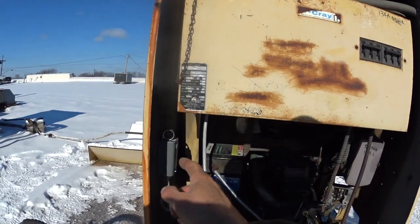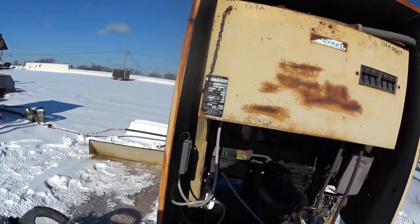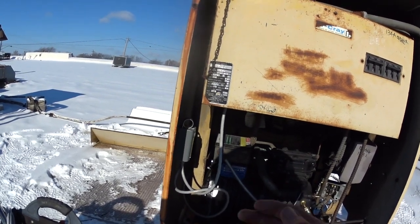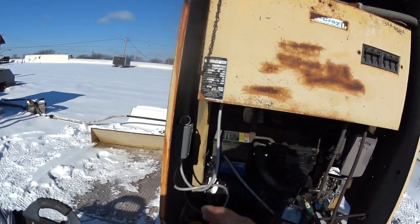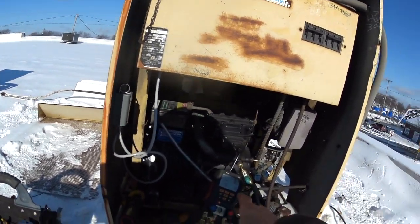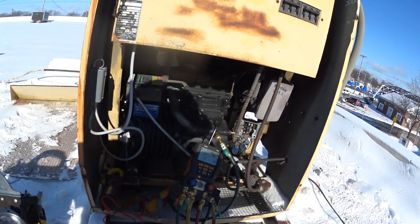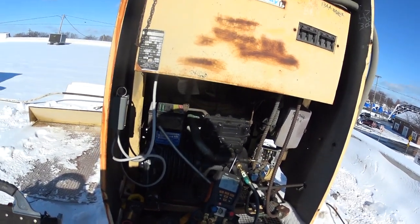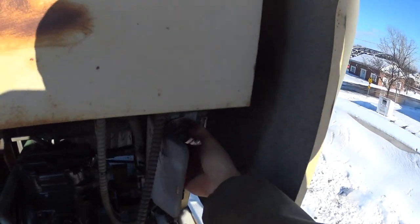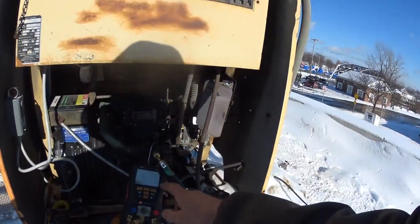This will sense the air temperature — if it gets too cold, it will make contact and turn the heater on, and when it gets warm out it'll break contact and shut the little heater off. Now the compressor is running, and it warmed up the refrigerant enough so it expanded just enough to kick in the pressure, and she should start pumping down for us.